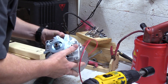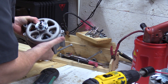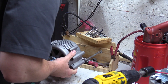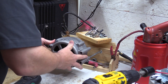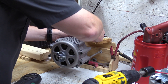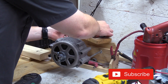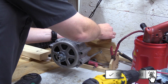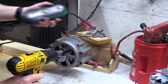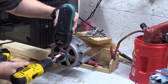We're going to pull off the alternator and set it aside — it's awaiting its ultimate demise in our next video where we're going to tear it all apart. Now we're putting on our legacy PMG. We've got our three wild AC legs coming off of it. One of the things we're going to see on this motor is that we probably can't even get anywhere near the same RPMs because of the amperage it's going to be putting out. So we'll line everything up and start it up.